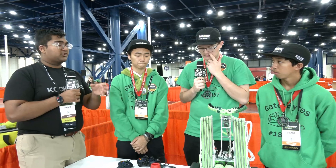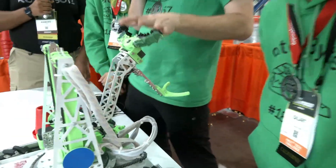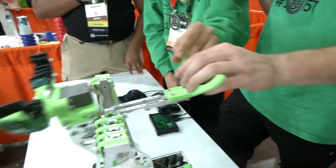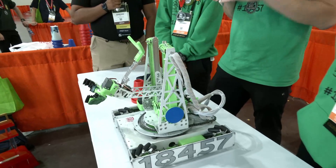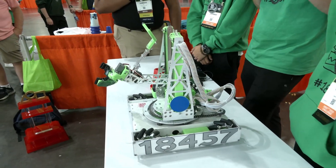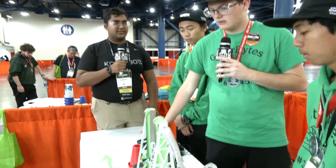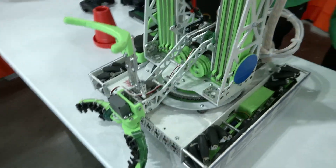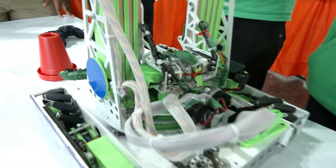Let's jump into your arm — you guys have a super long arm. Tell me if the design has been the same throughout the season or if it's changed. We started out with a virtual 4-bar, which was really good — we also had it on our regionals robot, which we won the SoCal championship with. But going into Worlds, we decided we needed to switch our strategy to a pass-through. We took a lot of inspiration from what Terabats was doing in NorCal, and it was a great way to score cones — we can just collect and pass through, which helped our auto and teleop become much more consistent. We used dual Axon Max servos mounted on the back of the lift, running the arm directly off a servo power module for extra power, which makes our robot really fast.